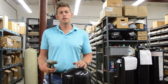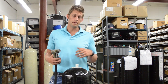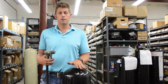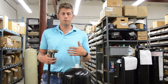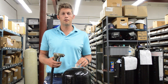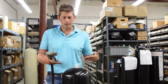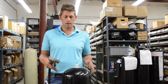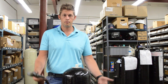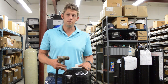Once this is done, you can put the unit into service, but you don't want to send any of that carbon dust downstream. You'll want to flush that to the drain — typically people use a pail or garden hose and flush until it's clear of the gray. If it is well soaked and you've given it 15 to 20 minutes to fully soak and it is full to the top, you can also put your carbon filter valve into a step-through backflush and then put it into fast rinse and let it rinse down to service position. That fast rinse is the same as putting a garden hose on your outlet — water goes down through the media and up the center of your distributor tube, rather than backwash which is down the distributor tube and up to drain. The fast rinse lets you get rid of that carbon dust without the potential of losing any media on initial startup.